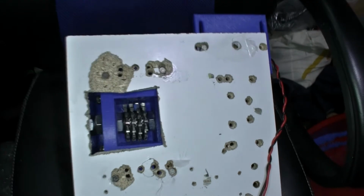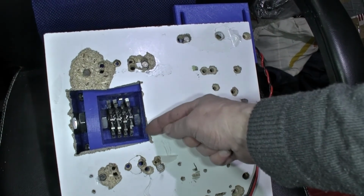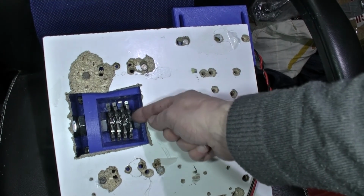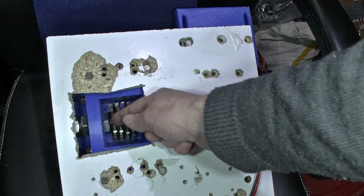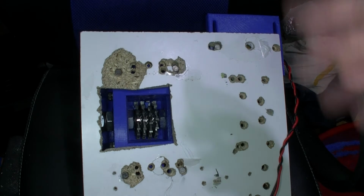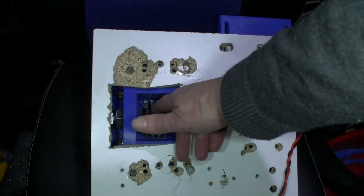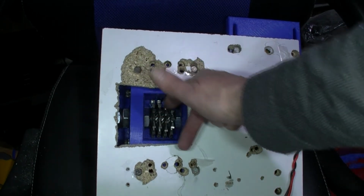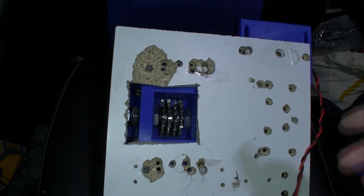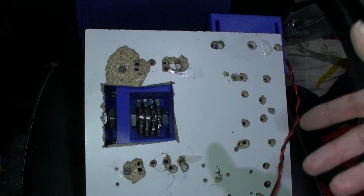Well, I can't see how it's jamming. The only thing I can think of here is when it did jam, because the shaft was turning but the blades weren't, it made these half nuts. There's just 2 half nuts there with a nord-lock washer on, and they're tightened up against each other. It might have loosened one of those off. Anyway, I think that's about as far as I'm going to go with this, to be honest with you.